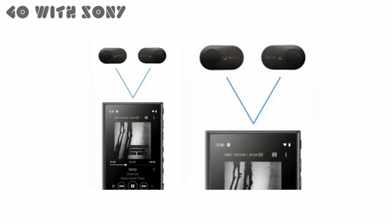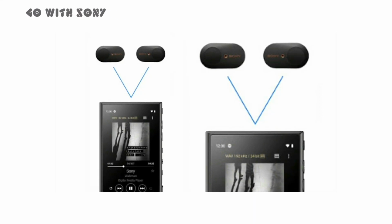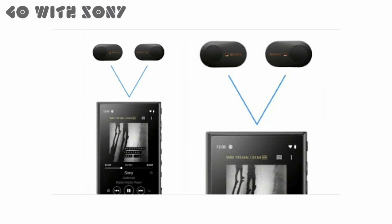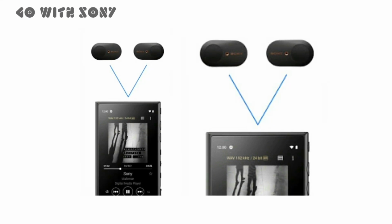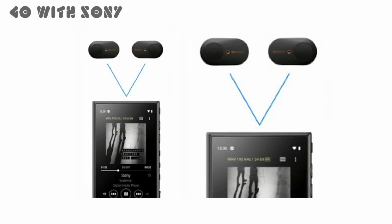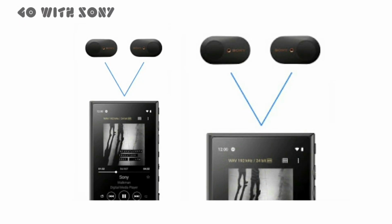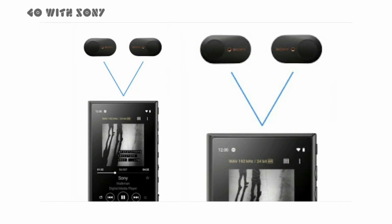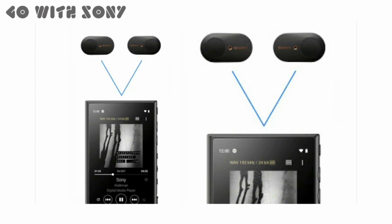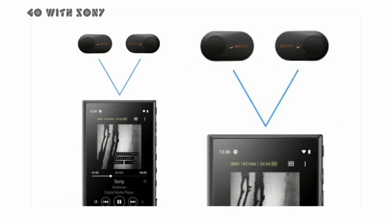So what has all of this to do with the WF-1000XM4? Well, that depends if Sony will use the MediaTek MT2811 again in the new headset. The MT2811 has been certified for Bluetooth 5.2 on Bluetooth SIG, and in the supported layers, the isochronous adaptation layer is mentioned, which are the LE isochronous channels. Likewise, Airoha chipsets, the AB1552 found in the WF-XB700, and the Airoha AB155X, the MT2811 in different clothing, also have been certified for Bluetooth 5.2. But these are just the chipsets and not actual devices.